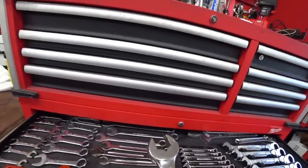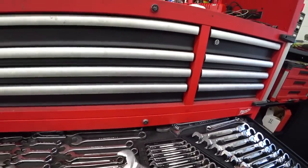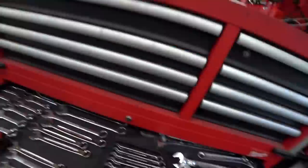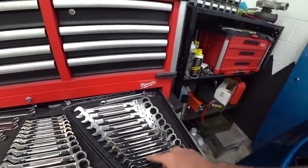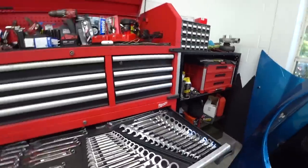Milwaukee also added knurling on their extensions for better grip, especially when your hands are sweaty. I finally got their flex-head ratcheting wrenches too. I've had the standard fixed ratcheting wrenches for three-plus years — they're my go-to because the open end grabs on four sides and releases with a click, so I've never had wrench slip. Normal open-end wrenches grab on two sides and pry apart. Their flex-head set goes from 8 to 22mm with no jump sizes, which has been very useful.